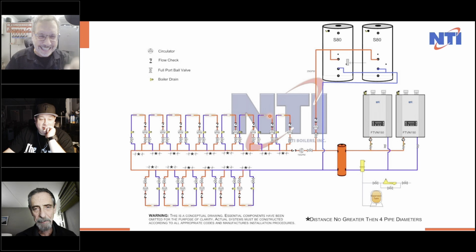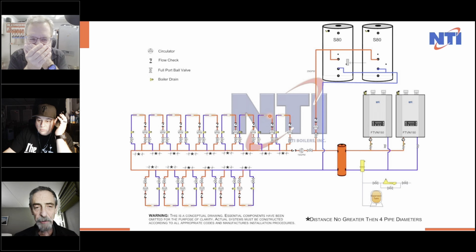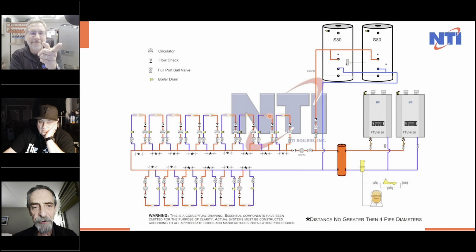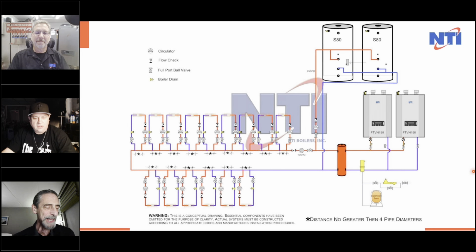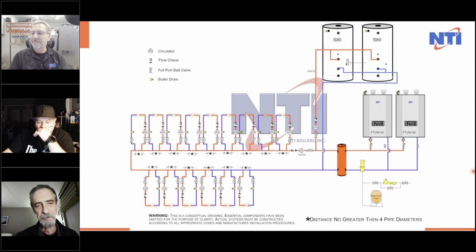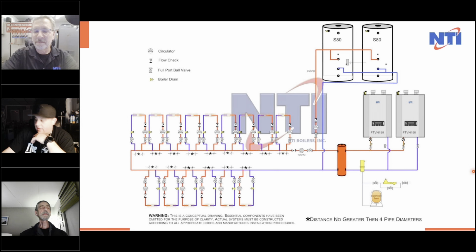Thermostatic valves. Well said, Dad. Why use a modulating condensing boiler on outdoor reset if you're going to put in thermostatic valves, where you have the valve set for design condition and all you get is one temperature out of it? That's stupid. You're defeating the whole purpose of the boiler. Exactly. It's obvious to use thermal regulation to be efficient. I understand thermostatic valves when we were talking about cast iron boilers that operated at a single temperature and you needed to protect the boiler. But they have no business in today's condensing world. No way. That's asinine. It's like eliminating your boiler.